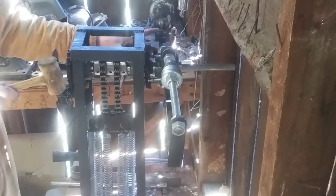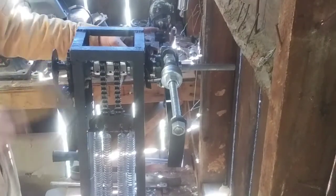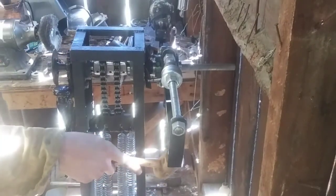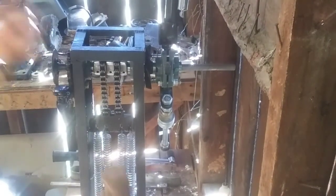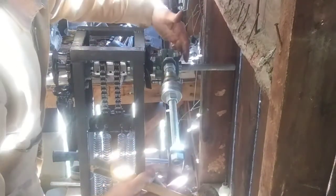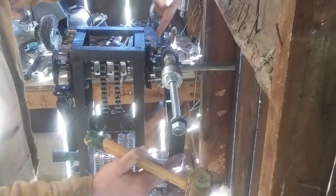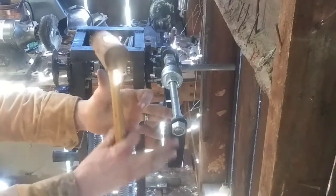So you take your rawhide hammer, and right at the moment that you strike that button, right when you pull that trigger, you have to pull your torch out of the way as quickly as you can. The motion would look something along the lines of that right there. You hammer your trigger, and you get your torch out of the way immediately. But like I said, right now we're just going to do this demonstration. You have to make sure that your firing pins are forward the whole time. Your firing pins must be engaged into that fan gear, and we will go ahead and release the machine.